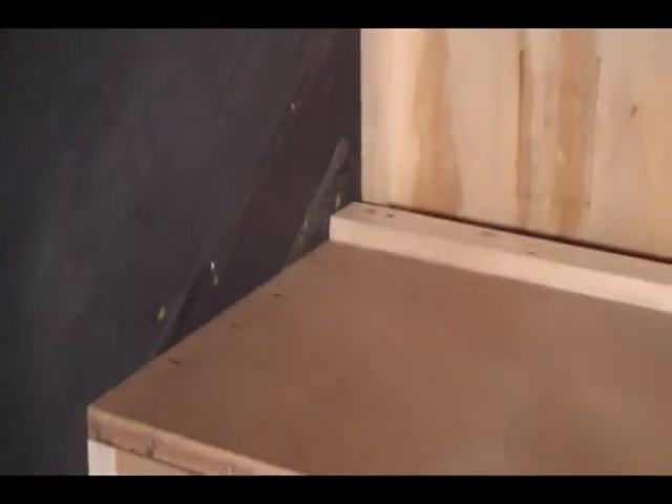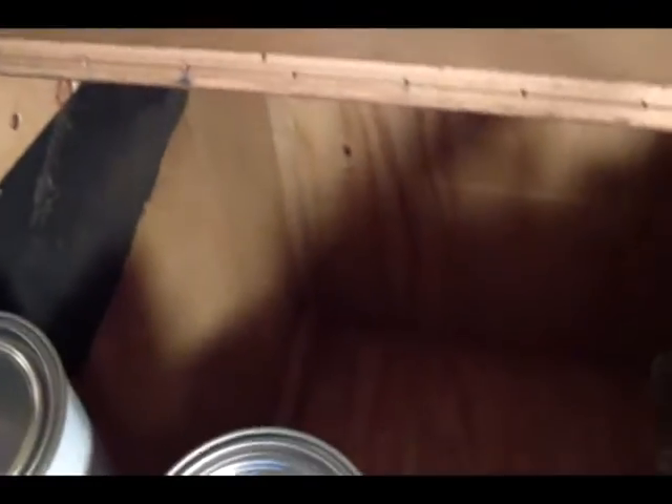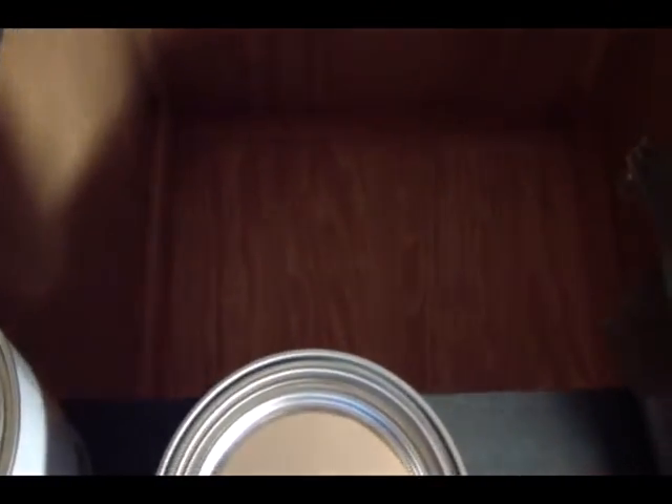We're going to do a little light sanding to the inside of the cabinet. Some places like where the old monitor was mounted — you can see where the old shelf was installed — I want to sand that so it's not as noticeable after painting. We already have pre-sanded plywood on the bottom and back panels. You may see a little wood grain through it, but hopefully the primer will cover most of that and some imperfections. Then we'll put the finish coat on later. We'll get busy on this outside and might show you some clips from that.